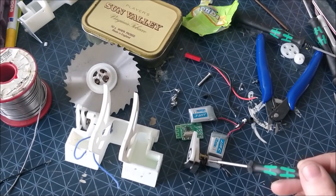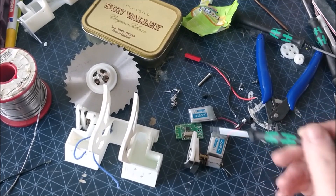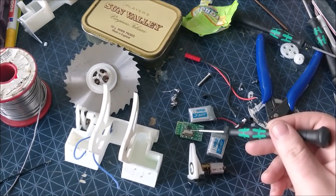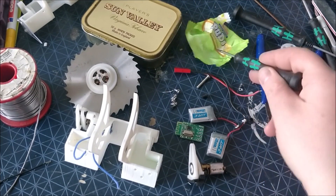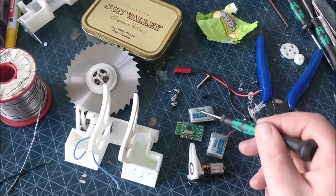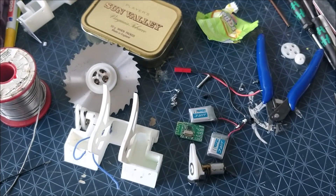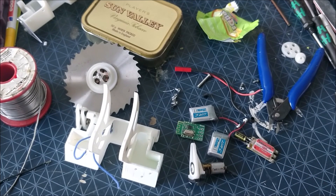The internal components for Shakma are fairly standard with an N20 gear motor, 250mAh LiPo cells and a Malenki Nano ESC. I got this from BBB which came with some free sweeties. The weapon motor is an SK3 brushless outrunner which is controlled by a King Kong branded 12A brushless ESC.